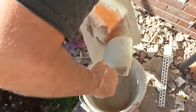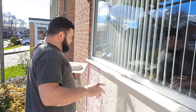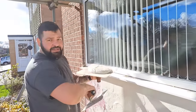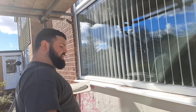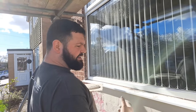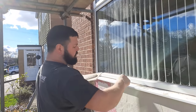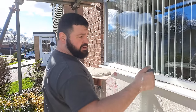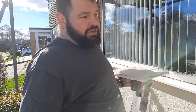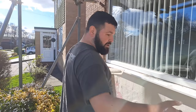When you're rendering, you want to be working from right to left if you're right-handed. If you're skimming a wall as a right-handed person, you'd start at one side and work the other way because each time the heel leaves a line in your finishing plaster and you're overlapping your heel line. But when you're rendering, you come back the other way because if you're putting on any sort of thickness, the stuff has a tendency to drop off again. Going right to left, as you're putting it in, that top bit where you're coming off the wall ties the stuff into the last stroke so it doesn't fall off as much. You just end up dropping less working right to left.